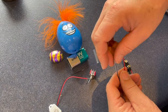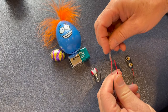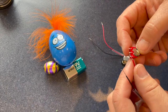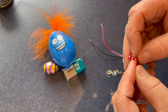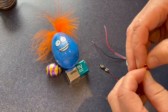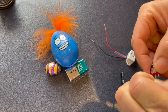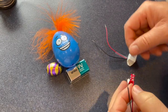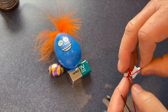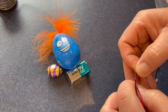Use heat shrink cut to length on the wires before we start to join the wires together. We have a simple toggle switch. The terminals are solder joints so they have a hole through them. Pass the wire through and twist it so that it holds it in place — this provides more mechanical strength than the solder alone.